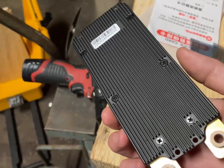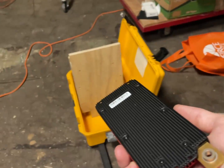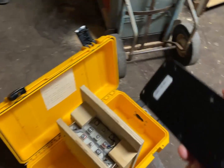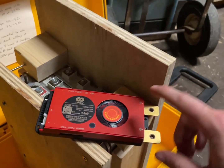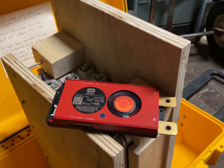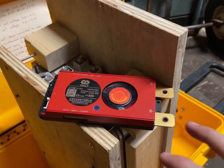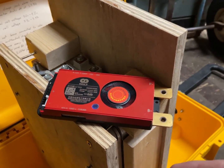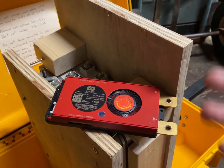This is the kind of thing I would use for a small electric car — for instance, my city car. My city car uses 48 volts, but it turns out it actually has a split winding for the motor. And if I were to run those two in parallel and have them run by a motor controller, it might be 24 volts.